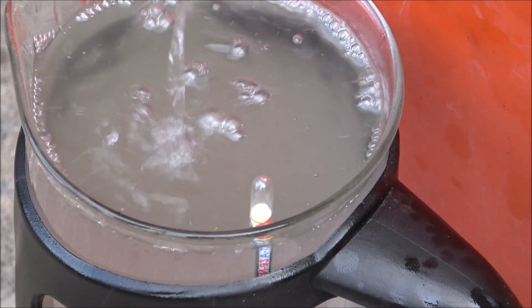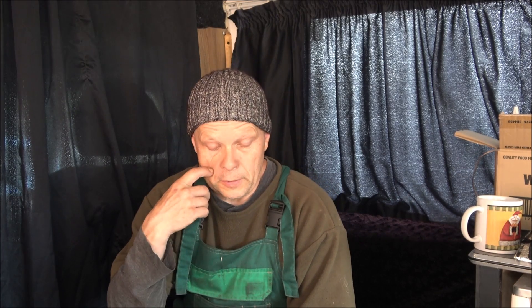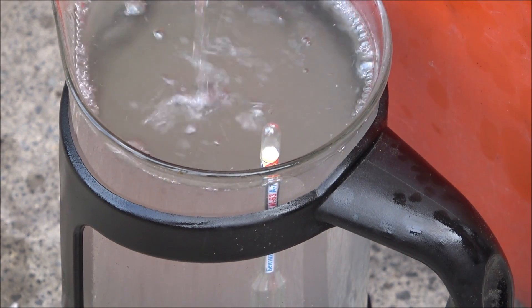Here's our recovered petrol. The petrol appears to be quite cloudy, I believe due to the presence of water within the unit. After constructing the unit I checked it with water for any possible leaks — I filled it up and left it for a while, and I believe not all the water evaporated. It wasn't dried properly.